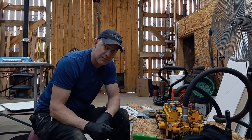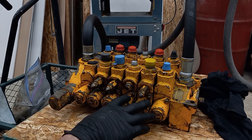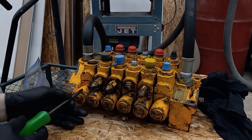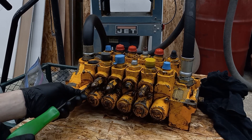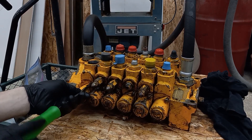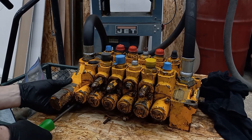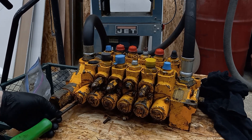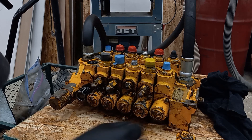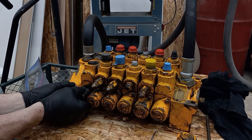Let's get one of these little cups taken off and get into it. So this has six valve bodies right across there. These are the valves that direct hydraulic fluid to each individual cylinder to make that big arm — the hoe — dig and put the outriggers out. Each valve body has this cup on the bottom. This is actually the bottom of the unit; these come out the back and the top is up here. Take these two screws out — they're just diagonally from each other. And take this and just pull on it; it comes right out.